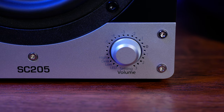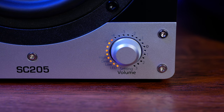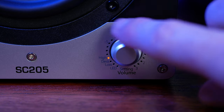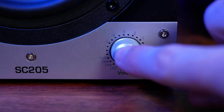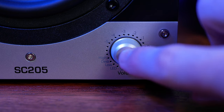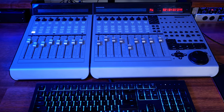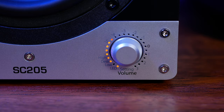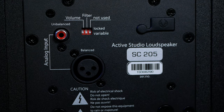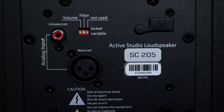When switched on, pressing the knob will put us into settings mode where we can access the DSP features. The DSP features consist of three filters: low, desk, and high. We can also adjust some LED settings here. The low filter allows you to adjust a shelf at 300 hertz, and the high a shelf at 3 kilohertz. The desk filter has two functions: when turned down it acts as a narrowband EQ at 180 hertz to help with the effects of reflective surfaces such as mixers; when turned up it boosts at 80 hertz giving a bit more punch to the low end. Once you have your monitors set up to your liking, you can use the dip switches at the back to lock in your volume and filter settings so that you don't accidentally adjust them. These settings will also be saved when the power is disconnected.